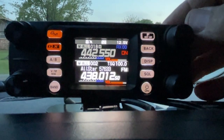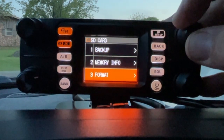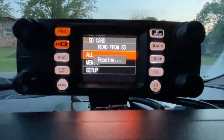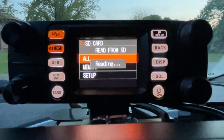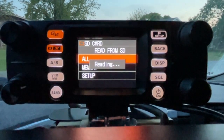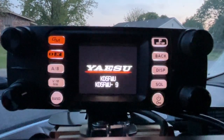Once you're done there, close the program and go put the SD card back in the radio and power it back on. Then hit your menu, go to SD Card, go to Backup, click on it, hit Read from SD Card, choose All, go over to OK and hit your button. It will read from the SD card and upload it to the radio — takes just a little bit. Once it's completed, the radio should reboot. There we go — start anew with a brand new code plug.